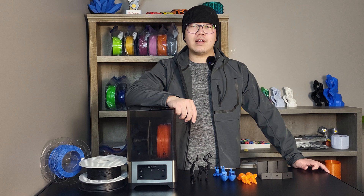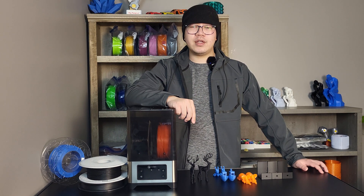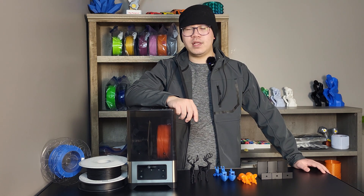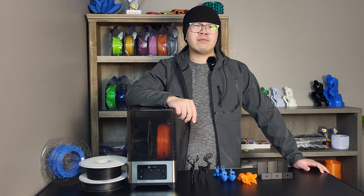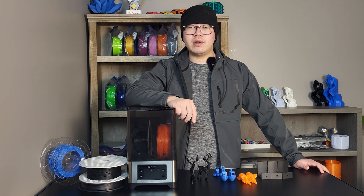How do you find out if your filament is too wet? Besides referring to the humidity level from the hygrometer, the simplest way to test your PLA filament is to bend it to 90 degrees. If your PLA filament snaps very easily at this angle, it is the most obvious sign of wet filament. Wet PLA filament may cause printing issues like bubbles, stringing, under-extrusion, and the finished part will be very brittle. Sometimes it might clog your extruder. You may hear some popping noise during printing — this is less common with PLA and more common with PETG filament.